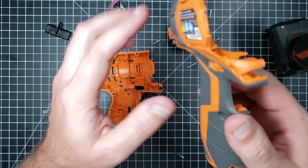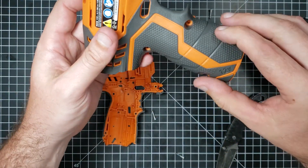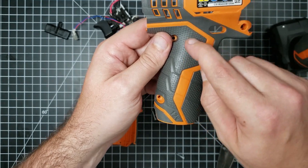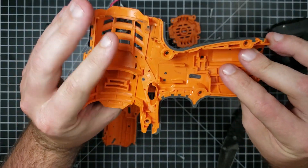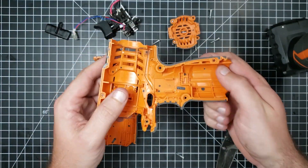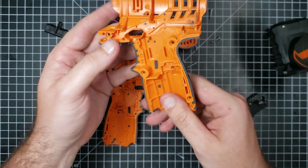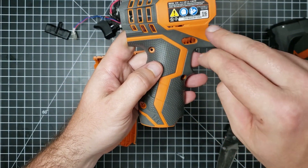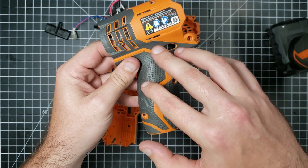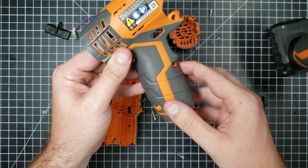Let's start with the over-molding process itself. This is a hard plastic everywhere — there's an orange skeleton basically of plastic. Then, probably within the same tool, they do a secondary injection process of the soft rubber grip. One reason you'd do that is for cost — if you don't have to take the orange part out of one mold and put it into another, that saves labor, time, and you don't have to have two machines. Another benefit is if you do it in the same mold, this rubber will actually be injected onto the plastic when it's still hot. So if you make the polymers similar, you can make them actually slightly chemically combined.